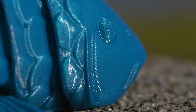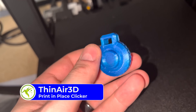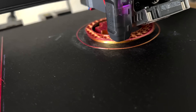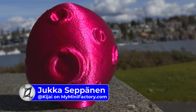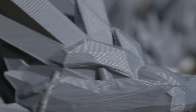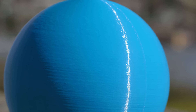Right out of the gate, test prints from this machine looked fantastic. There were some prints where the clearance wasn't there and the prints fused because they were print-in-place models, but more time with the machine and the slicer would make that successful. The S1 handled some tougher prints pretty well — there was the Moon City by Zhakaséphane, and also the Crystal Dragon from Cinderwing 3D. Both of those models looked fantastic. PETG on the machine was super easy — you just modified some of the PLA temps to PETG temps and you were off to the races. Even TPU printed extremely well.